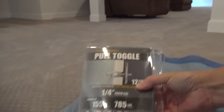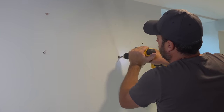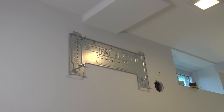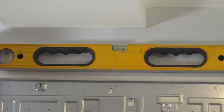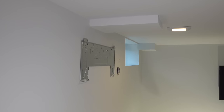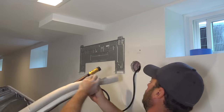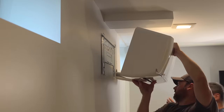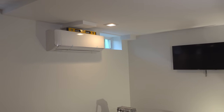Now we're ready to mount the bracket to hang the inside unit. Don't waste time trying to hit studs — just use pull toggle bolts, a great contractor secret that hold 155 pounds each. With screws in place you can mount the bracket. Keep all the screws a little loose at first because there's some play in the bracket that lets you level it completely before tightening all four screws. You don't need tools to mount the unit itself — it just hooks onto the top clips. Before you do that, bend all the hoses and connections pointing out the back, feed them through the hole, and then press the unit fully into position until it locks in place.